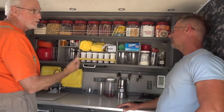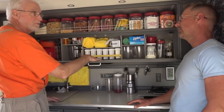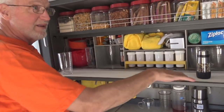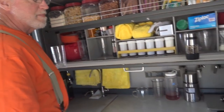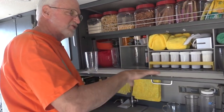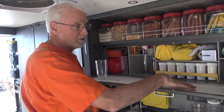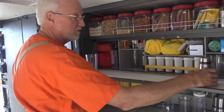The lower section is still a drop-down door. I liked that, so I made it a little bit longer. I put some 3M safety walk on it to keep it from slipping. When I put it out of the way I don't want it to slide. This is 3M safety walk — it's just a fairly thick textured vinyl with adhesive back. So the door is quarter-inch plywood with birch hardwood, but the surface is covered with 3M safety walk for durability and so that things don't slide.